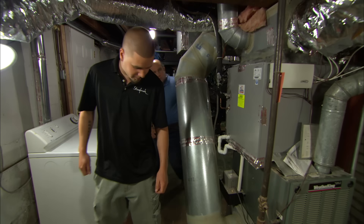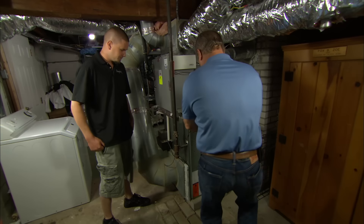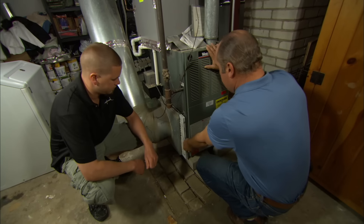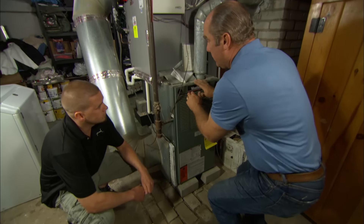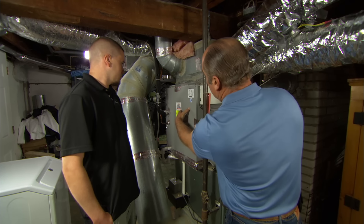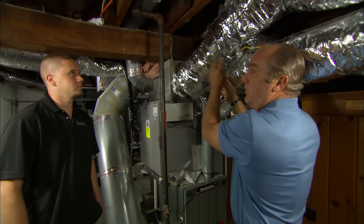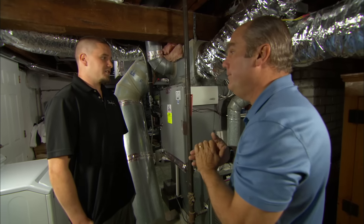So Richard, this is the air conditioning unit. There's a gas-fired furnace for heating right here. The return air comes back from the building, up through the furnace where a blower pushes it through to be heated. The air can also come across this box right here for cooling — there's a cooling coil here. The air goes up into this box at the top called a plenum, and right here are the supply ducts that go out to all the individual registers. That's how it's supposed to work.